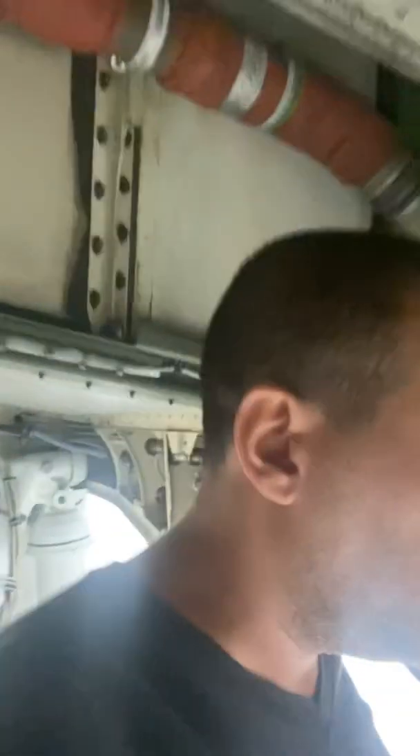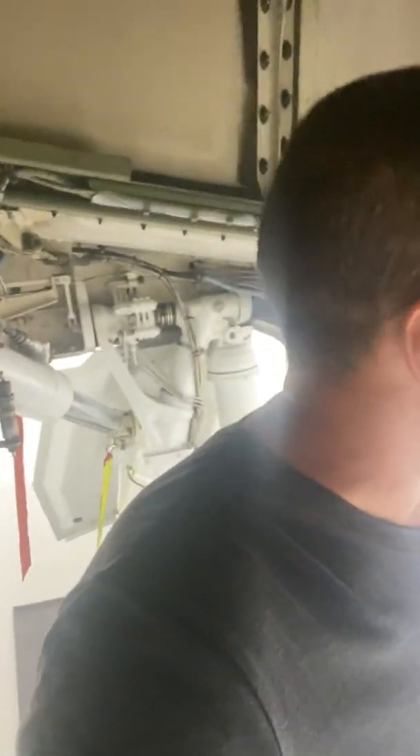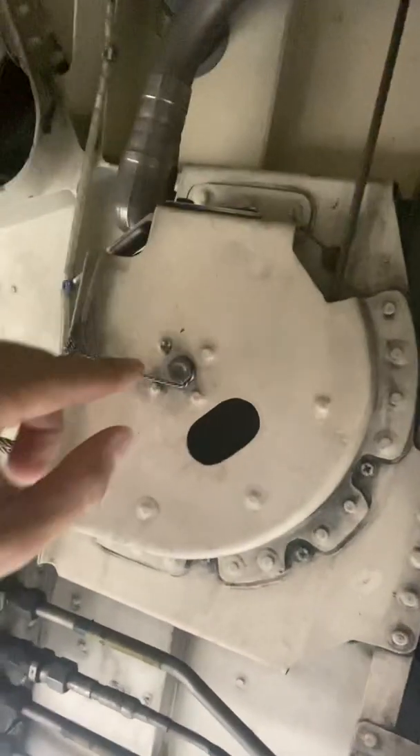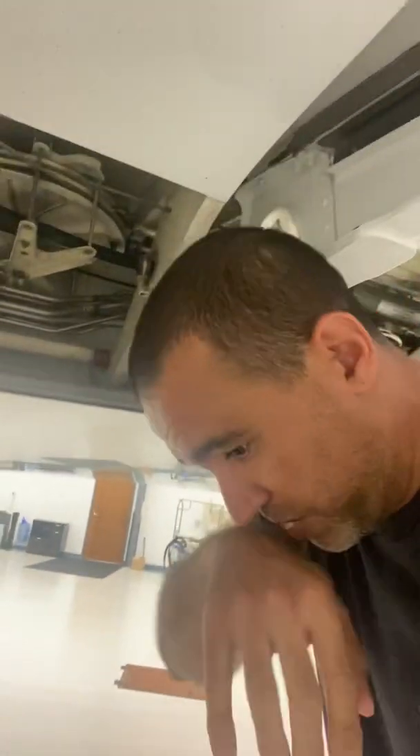One of the things I've come across during pre-flights and checking airplanes for clients — when it comes to these pulleys, this safety wire right here: there's a rule from maintenance school — 'righty tighty, lefty loosey' — basically the rule of thumb for safety wire. If the screw tightens to the right, the safety wire has to be tightening that screw. I've seen many airplanes, especially Gulfstreams, where that safety wire is put on backwards. It's pretty confusing because you have to do the safety wire upside down in some cases. I know your maintenance guy is supposed to catch that, but this is something to look for.